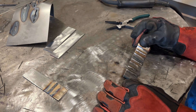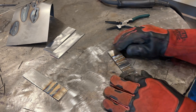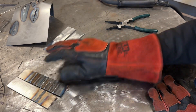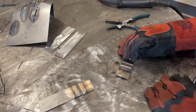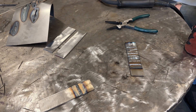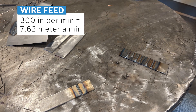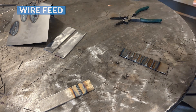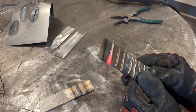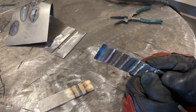At this voltage level we are going to be somewhat limited. Just out of curiosity I'll keep it at 19 volts and lower the wire feed all the way to 300 inches per minute. Yeah, it's not going to flatten out anymore — but that's actually not a bad looking weld for what it is.